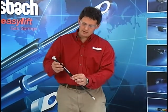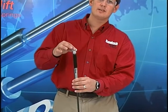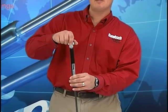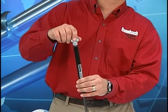From this point it's only going to be about one and a quarter turns until it starts releasing the pressure inside. These gas springs are under high pressure — for example, this one is at 1100 Newtons, so the gas is going to want to escape very rapidly. Once the gas starts to release, you want to make sure you're ready to back the tool off very quickly, just allowing a short burst of nitrogen to escape.